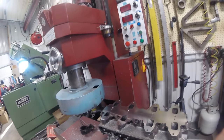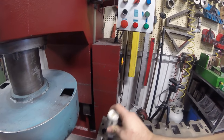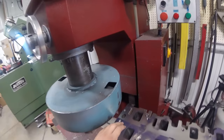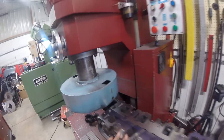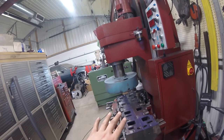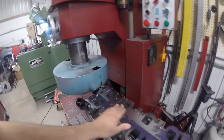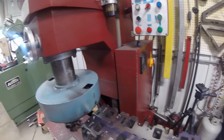I've got the heads flipped over to do the intake side and I'm putting some Dykem on here so you guys have an easier visual to see what this looks like when we surface it. After a real light pass, the blue is where we didn't touch and the shiny part is where we did. You can see that the angles on these heads aren't always right - whether from the factory, or during this era there was a lot of sketchy machining. On top of that, these heads may have been surfaced before on someone else's machine or done incorrectly.